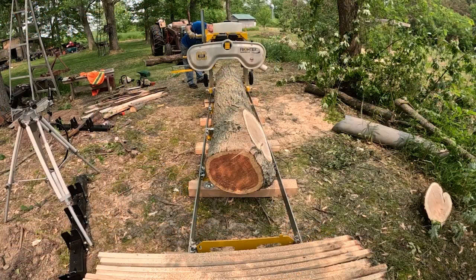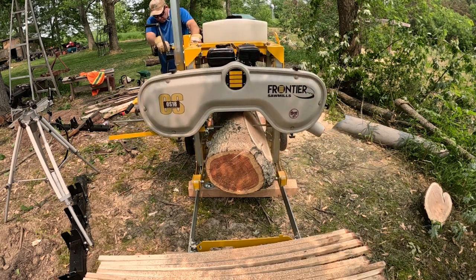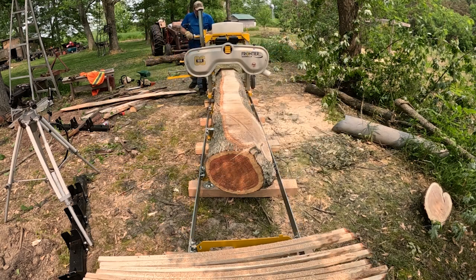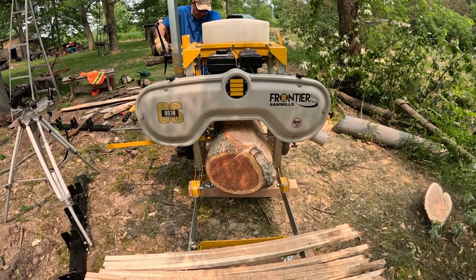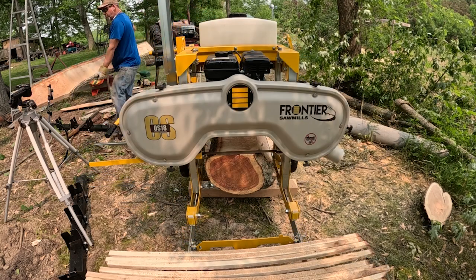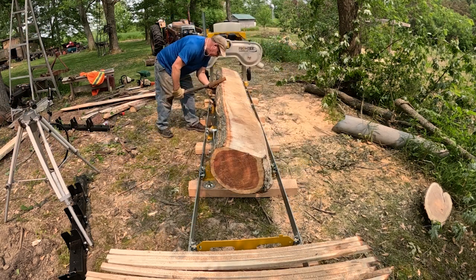I think this is a pretty good sized log. Rather than try to cut to a particular size to fit the trailer, I'm just going to square off the log to the biggest cant I can work with and then let the log tell me how big a board I can make. Based on how straight the log was, I guessed I should be able to get boards about an inch and a half thick, maybe a little more, by four to four and a quarter inches wide. There's more than enough log there to get the job done — let's see how close I got.